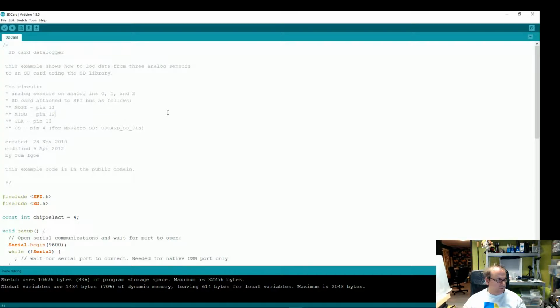Yeah, that was cool. So now I think I will also give the Ethernet module a try. Oddly enough, in the instruction that I read, it mentioned the Ethernet module. So I think that it actually has the same cable connection, because it's running through a serial connection, SPI serial connection. So it seems like the Ethernet module uses, at least control pin wise, the exact same pinout. So it should be relatively easy to test out.